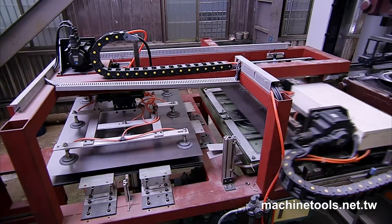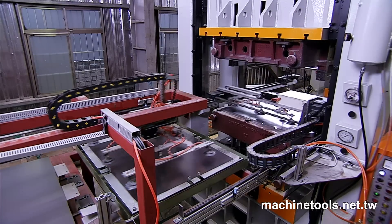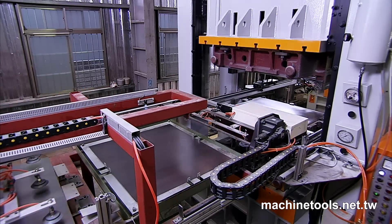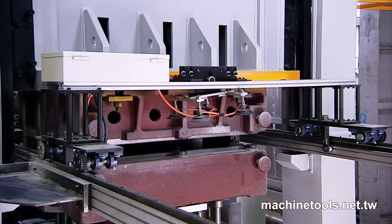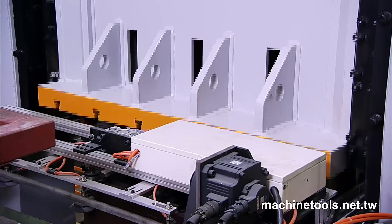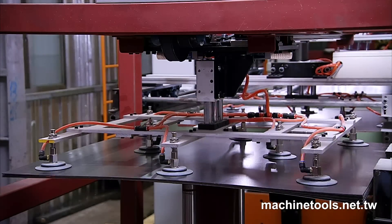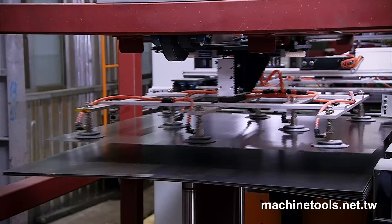If you're looking to fully automate the process, Wittori offers the integration of robotic loading and unloading units, moveable bolster and automatic die clamping and changing. These additional components offer significant safety benefits along with lights-out operation capabilities.